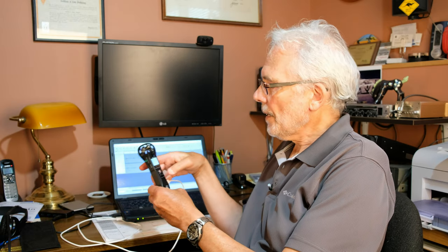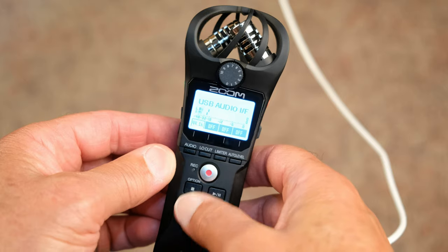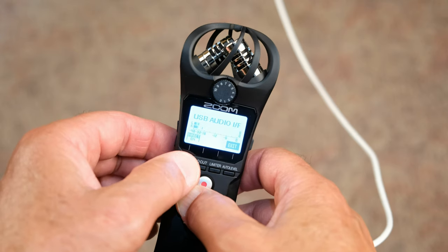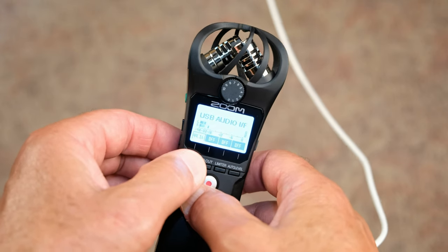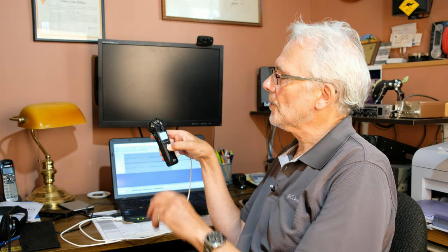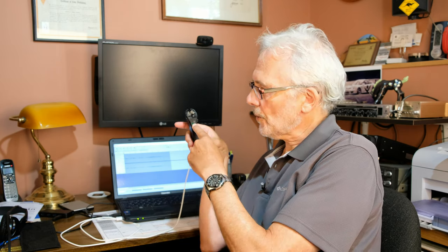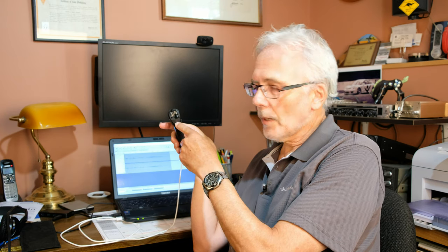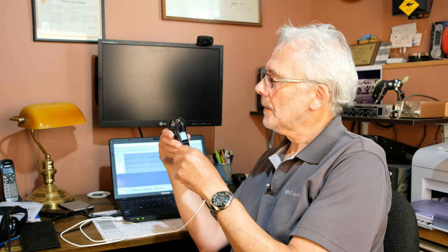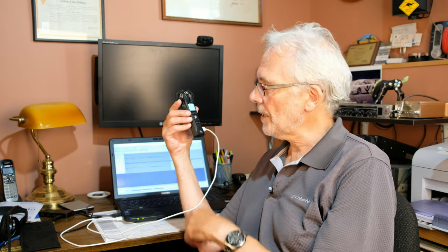There's one other setting: if you hold down the option/stop button and hit the audio button on the top left, it may say 'Direct Off.' Just hold that stop button again and hit it to toggle to 'Direct On.' Direct On means when you plug in headphones into the headphone port, you can hear yourself directly as you speak into the mics — without any delay.